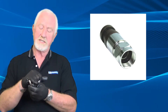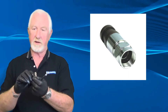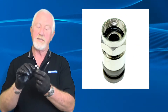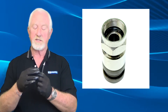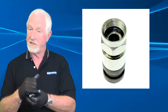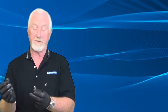In a piece of coax there are two conductors: the center conductor and a ground in the braid and the foil. The connector doesn't really seat itself in the digital world until it's tightened down properly. Also in this connector there's an O-ring inside. When it's tightened down to the interface, it prevents moisture. As the cable expands and contracts with temperature, air — which carries moisture — is drawn in and out down the threads, which starts the corrosion process. This connector with an O-ring prevents that, or you can use weather seals on the outside.